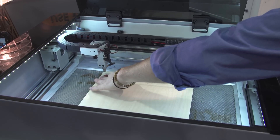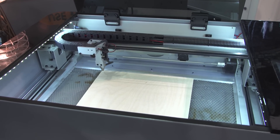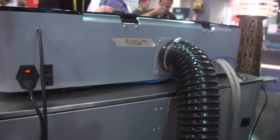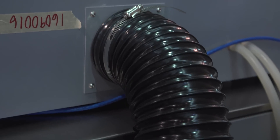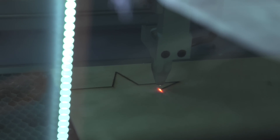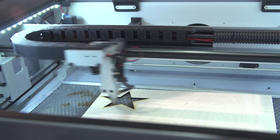We also sell large pro machines. The biggest difference is power — this is a 45-watt laser tube versus a 90-watt tube on our pro machines. Size and portability matter too. This is a very small machine. You can pack everything inside, move from space to space, take it into a makerspace, move it into your garage, exhaust out the window. It's really a versatile machine — whether it's in an education space with a bunch of them in a row, or just sitting in the corner of your garage, this works everywhere.